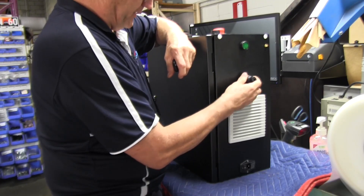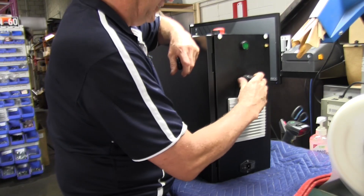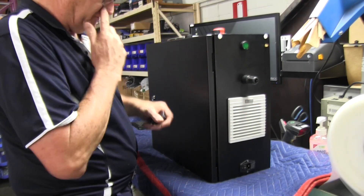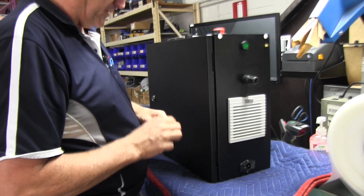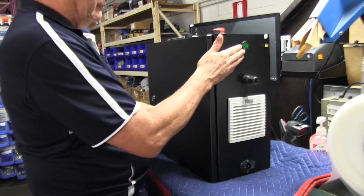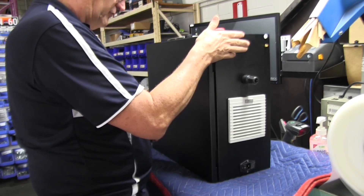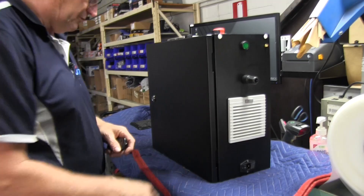In this control panel we're also using a safety relay, which has added a little bit of extra complexity. Instead of using LinuxCNC to turn the safety relay on — which we could do — we decided that we will have a trigger here on the side, out of the road, and we will be able to trigger it there.